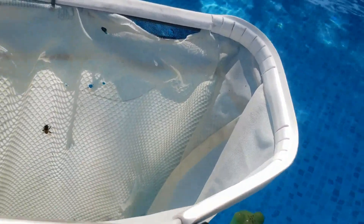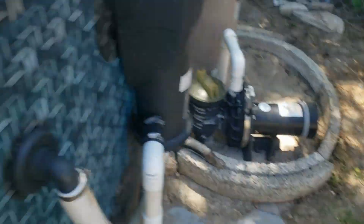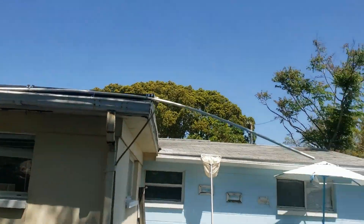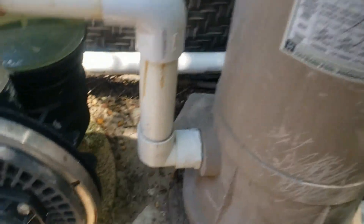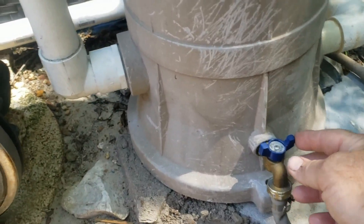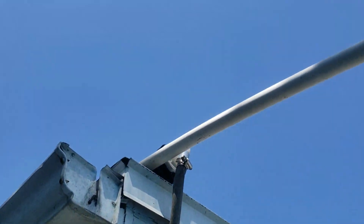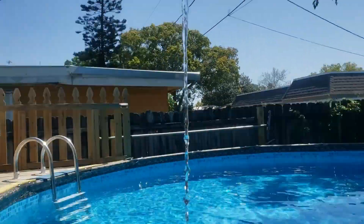Save the bees — come here buddy, I'm going to save you from the water. Hopefully you can dry out and fly away. So how I turn the flow on to the heaters up on the roof is just right here at the bottom. I put it on the drain of the filter housing, so you turn it on full flow. The water just travels through the hose — I have it buried right here, but then it goes up the side of the wall, up to the roof, through the heaters, and returns back here.